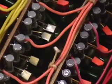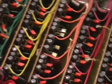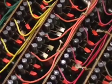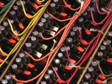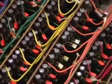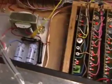Now, we simply substituted a couple across there at one time and didn't notice much of a change. It didn't want to flip. But when we did a resistance reading for the points of the circuit, we noticed an unusually lower resistance on that one side. And we took the capacitor out to be sure, and it turned out to be leaky. Just too leaky to work. We've replaced it, and that's it.